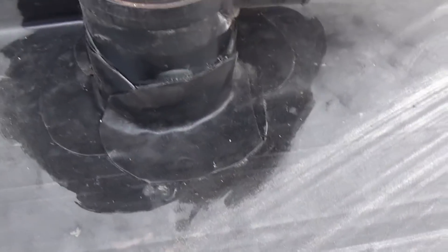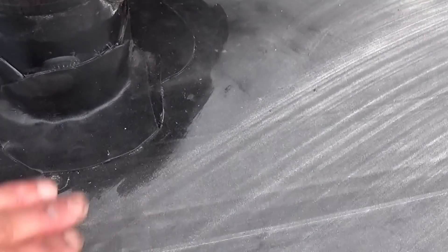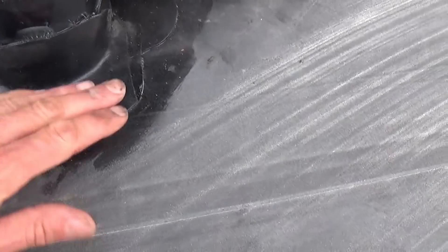These are strips of material that you can buy and you add them on with a primer - paint the primer on and stick these on. I cut them into circles, which is best recommended because they're easier to mould into shape. You put it on, stick it in, and you can really pull it tight with your finger and all this will start to stretch - very much like fixing a puncture on an inner tube, because all this material is very similar. The primer basically bonds it to the pipe and bonds it to the rest of the rubber, and that stops the leak. I've done four of these all around the hole, and a vertical strip down the back where there was a join in the cut to get it around the pipe - and that last strip runs on top of the other ones. For the corner cuts, we did them like flaps - a cut across, then sit one flap over the other so any water running down runs onto the piece underneath. We've gone across the top with a load of sealant to fill in the gap, and that's really strong sealant that matches the rubber.